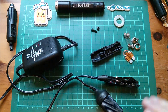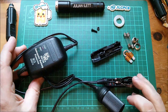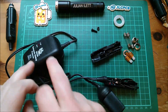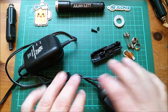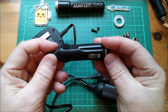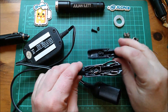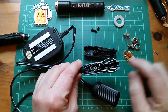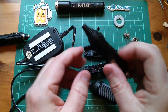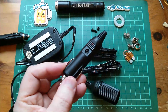Good morning all. I still need to fix this Maplin 10 amp continuous automatic battery protector - low voltage - it turns the relay off if the source battery goes to too low a voltage. Here's the original plug that came with it which melted at 10 amps. Here's the replacement cheap eBay plug - UK seller actually - which also melted at 10 amps, and here's the one remaining. I bought two of these plugs and I've got one chance to get this right.